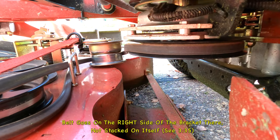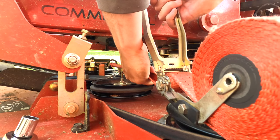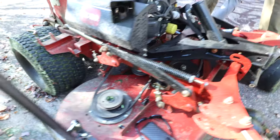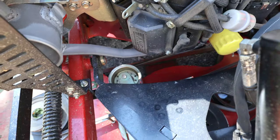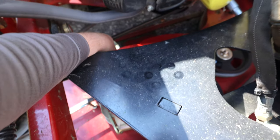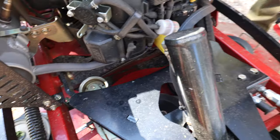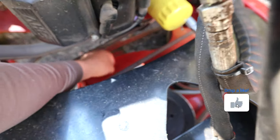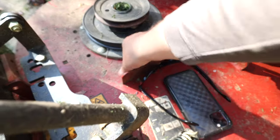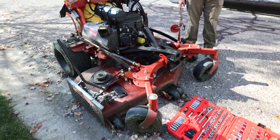I'm on the spindle pulley. Go ahead — try to pull this way slowly. The tensioner just went back on and I think we're good to go. That wasn't too bad — took us about 15 minutes. Double check your belt guides; we had them crossed. So you can change a deck belt on a Toro Grandstand Multi-Force in 15 minutes, or five minutes once you know the tutorial.